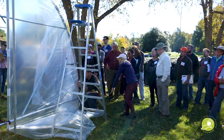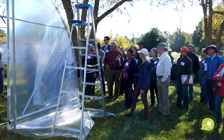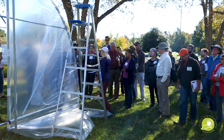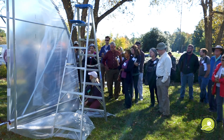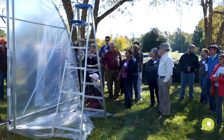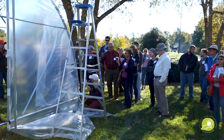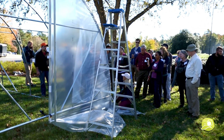You could leave a little excess plastic that comes all the way down and either attach it along the base, sandbag it in place, or whatever you want. You can roll it up — it's usually better to just have it free-flowing so if you're going to be opening and closing, it's accessible. You could also attach EMT lengths along the very edge of it to have a point to roll up to and to weight it down. That's in the instructions as well.